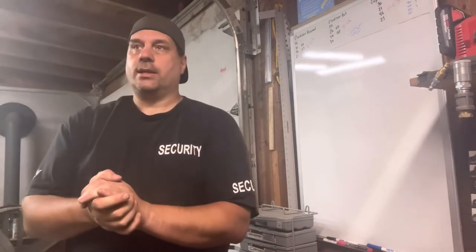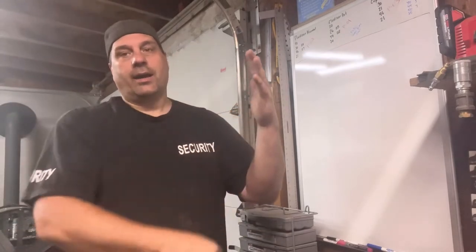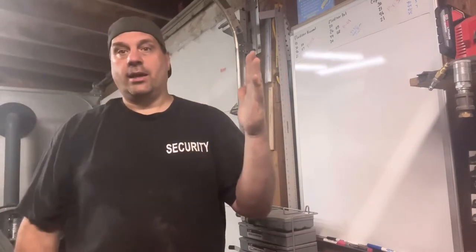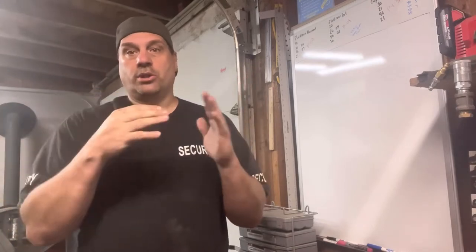How he explained it to me is, he goes, first, your KV is charging your particles. So your KV is charging your powder, okay? And your microamps is the power behind it. So a terminology he used to me, he goes, okay, you take a punch. If you just punch like that, it doesn't hurt, okay? He said, that's KV. KV is the punch. Okay, you put microamps behind it, which is the power, okay? This is low microamps. He goes, turn the microamps up, then you can knock somebody out. So the microamps is the power that is pushing the particles.